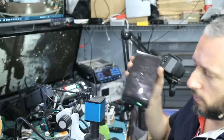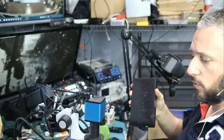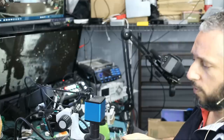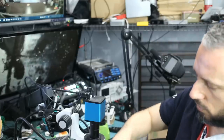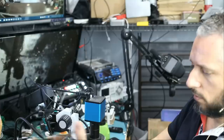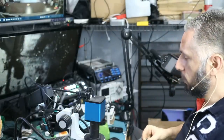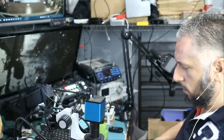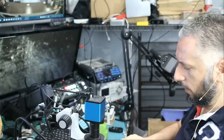Now, I told Big Boss to try another battery. We did, and we were able to get the Nintendo Switch to power on. So a battery did power it on, but charging is not working. So a couple of things can cause a no charge, including a bad USB-C port, charging IC, fuse, short, a lot of things.